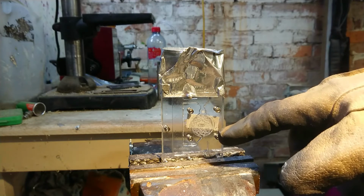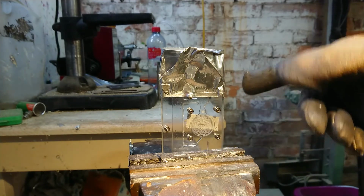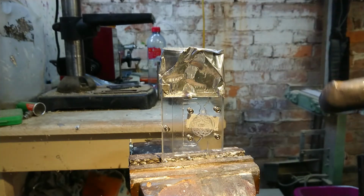Okay, so our mould is assembled, and I've put some aluminium tape around the top because the 5 packets of blue tack that I bought for this job have gone MIA. I'm pretty sure my apprentice is to blame, but can't verify that yet. Anyway, off camera, behind here, my wax is melting. I'm just about to decant to a smaller container, and then we'll be pouring pretty much right now.